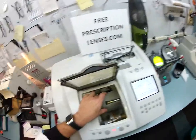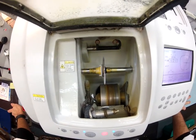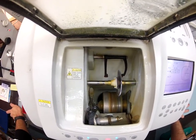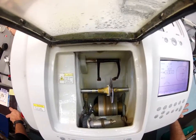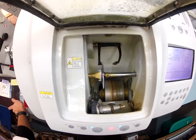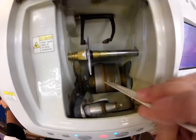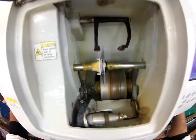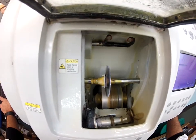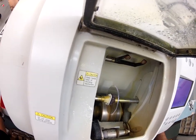Now I'm going to put this in the chuck and it's going to trace the shape of your frame onto the lens to make sure it is large enough to cut out — and it will. I've done the measurements in advance but this is just a routine operation I cannot get around. So it is now tracing the shape of your frame onto the concave side of the lens, which is closest to your eyelashes. Once it has done that, it's going to trace the convex side of the lens. Now these aspheric lenses are flatter — even though it's the convex side, it still does not give you that fishbowl appearance. These are high quality premium lenses, which I'll explain in a moment. The actual cutting wheel is down here on the bottom on the left — it is like a heavy grit sandpaper. This wheel in the center is what's going to put the bevel onto the lens so it stays inside the frame. This is going to get loud and I'll have to close the door, but for now I just want you to see your prescription lens strike the cutting wheel. Let's get started.